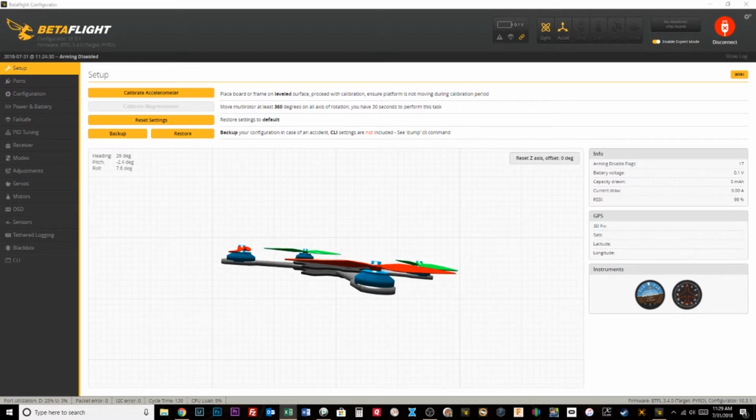Crossfire made a lot of people scratch their head. I remember at XDC trying to figure that out, because if telemetry is turned on in Crossfire and you have 2 quads bound to the same transmitter turned on, then it gets really wonky in regard to which one you're actually controlling. To get this to work on Crossfire, you have to disable telemetry in the receiver, and you do this either with the tiny screen on the full size Crossfire, or with Lua scripts for the smaller Crossfire unit. There might be other ways to turn off telemetry. Maybe ask Trappy, I'm not exactly certain.